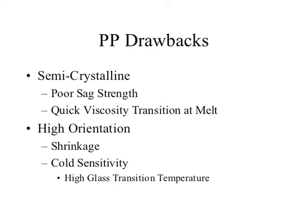Orientation is an industry term that can be referred to by different names. In the plastic industry, orientation describes what we call shrinkage — the reorientation of polymer chains into a crystalline structure. Reorientation determines how much shrinkage occurs. You'll hear that term used constantly in the written literature and orally within the plastic industry.